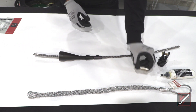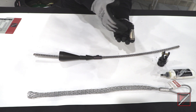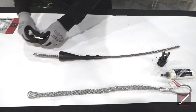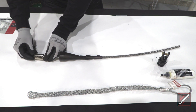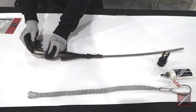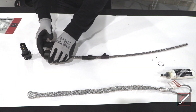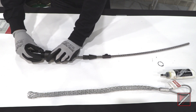The next thing you're going to want to do is take your jaw set. Make sure you put anti-seize on each face — all it takes is a drop the size of a pea, just wipe it across the whole face. Once you have anti-seize on the jaw set, come back to the cable and slide it right over. When you put the jaw set over the cable, you only want a quarter inch of cable hanging out behind it. Now to assemble your retention nut: slide your expander body back over the collets, being careful not to move them, and twist on the nut itself.